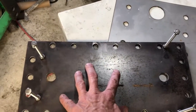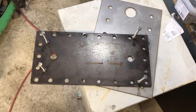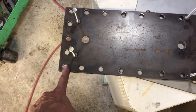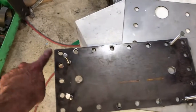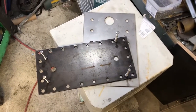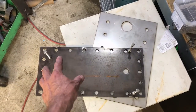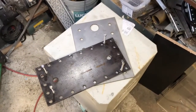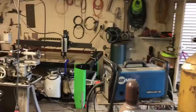You could not just do this by putting the drawing in there, doing the post processing, and then set it and forget it — it wouldn't work. I had to go to the minimized distortion section in the tool path and make it to where it would cut this hole, then go all the way over here and cut this hole. I set a 10-inch parameter limit on it, and for whatever reason in that scenario it forced the plasma torch height controller to do the pierce plunge. I ruined quite a few tips trying to hash this out.